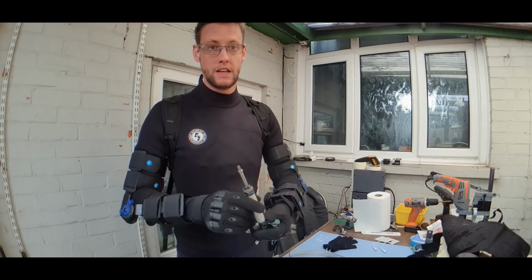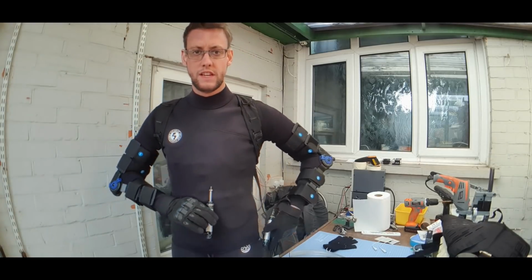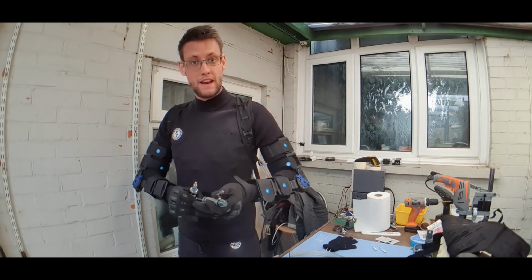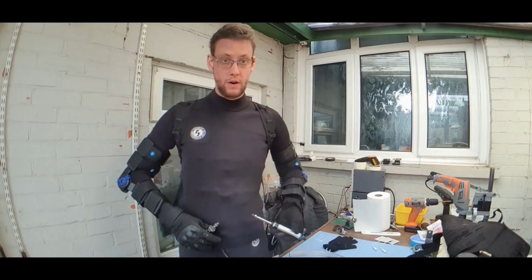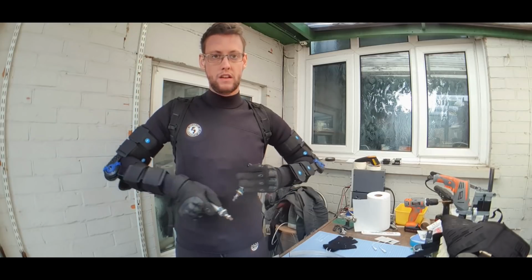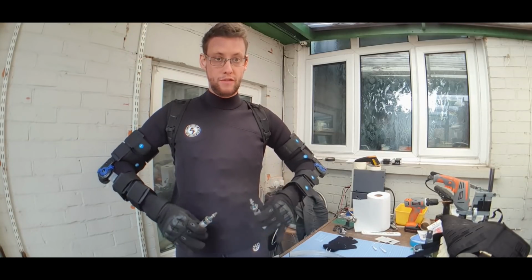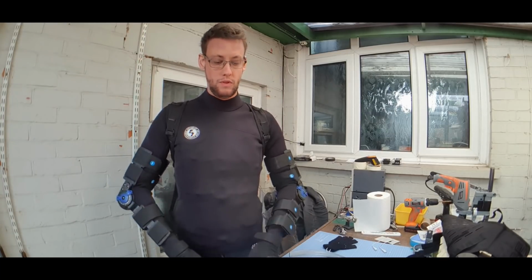these here, which are actuator pistons with valves, so a fluid would flow between these. Like I've said before, there'd be one at the front, one at the back. Effectively, when you bend at the front, it would compress this one, forcing the fluid out of this one and into the one opposite. So that would be expanded out, and that gives you the kind of floating joint that you need because of the compound nature of the spine. And the ring of the chest here, there'd be one coming off, at triangle-like angles to each other, something like this. So it'd come off of the chest ring and go down to a mid connection point, and then from there the other two would go from that midpoint to the waist, giving you that additional level of compound joints.